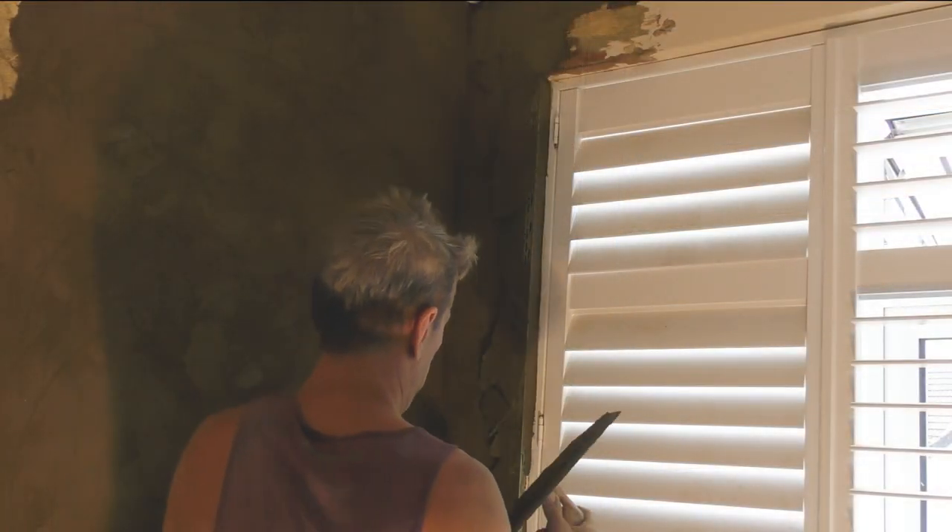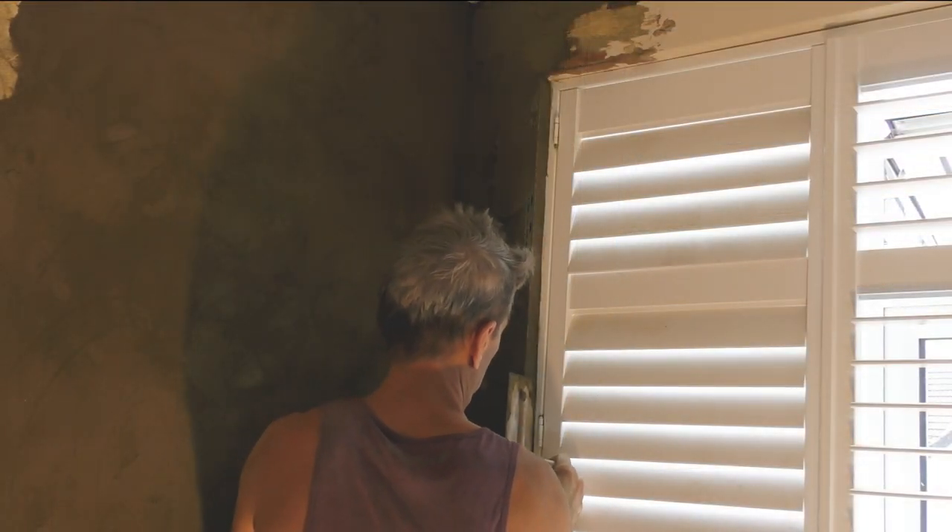Now here I've literally just pushed the bead into the sand and cement, so it's a loose bead - and this can be very fiddly. I've been doing this for years and this isn't something you'd want to do as a complete novice or DIYer. You need to have done a decent bit of practice with your troweling skills. While I'm pushing that reveal sand and cement on, you can't quite see it there - I'm holding the bead from the front with my hawk in my other hand.